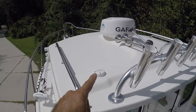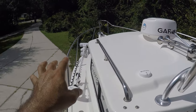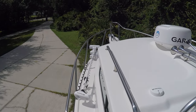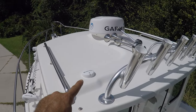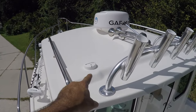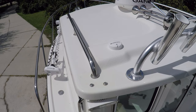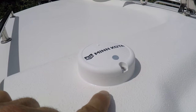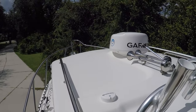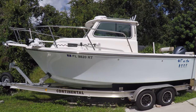It's all secure, all done, and all powered up — I saw the blue light of the Bluetooth turn on and it looks awesome. It's well away from everywhere so I'm not going to kick it. I considered putting it in the front but there's a possibility I'd hit it walking around that area, so here is a perfect spot. The antenna is over there, radar is here, and the heading sensor is in a perfect location — nothing is going to bother it. I put marine adhesive all the way around the puck so there's no moisture or salt water going in. If you found this video helpful on how to install your heading sensor, please give it a thumbs up. Thank you for watching — navigate safe.